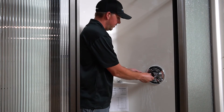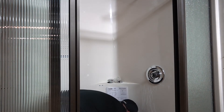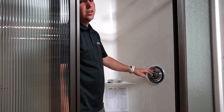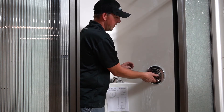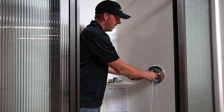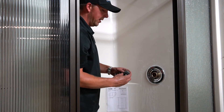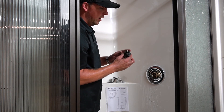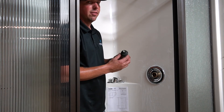We take that cover off — there's one screw you take off and the handle pops off. There's our cartridge. Sometimes a Delta will only have one handle. They do make different variations of cartridges and it's pretty straightforward. There's a locking nut that threads off. These ones you can usually just pull them out. Water is off — you'll get a little bit coming out but that's not a big deal. Usually when you take this out, you want to match it with the part number of the new one, otherwise the handle might not fit since they make different variations.